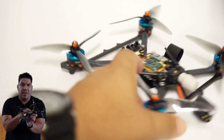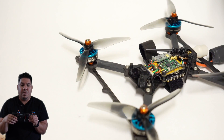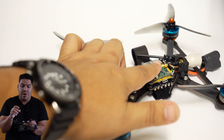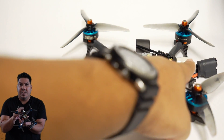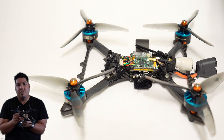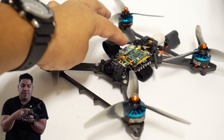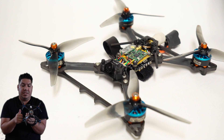Now on top of that, in this yellow or orange layer, you have your flight controller — that is the computer. All the things that interface with that computer solder onto that board, including your video transmitter. Your video system feeds video into that board, and then you pass video out to your video transmitter, which is found right here. That connects to an antenna used to broadcast the signal to your goggles, allowing you to see the FPV or first person video feed. The video is captured by the camera right here at the front. And in order to control the drone, you have a receiver right here that connects to your radio or transmitter and allows you to put stick commands in.